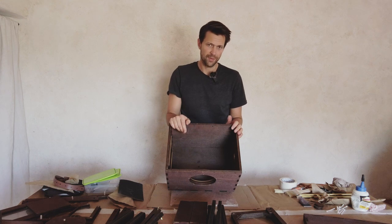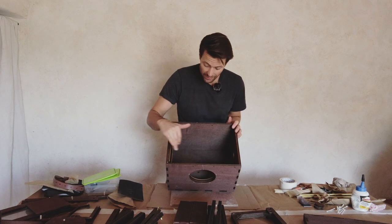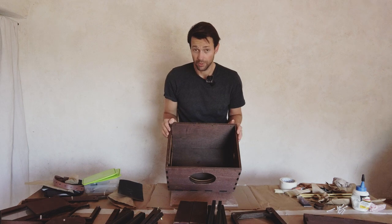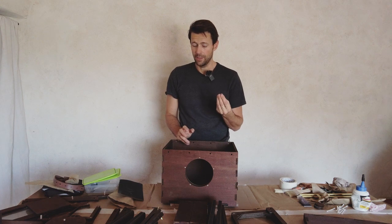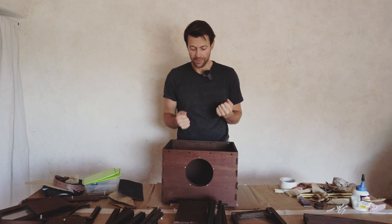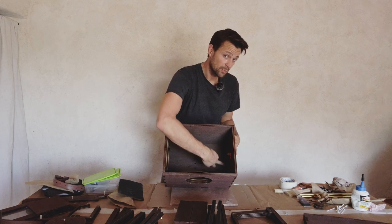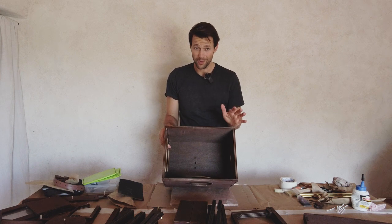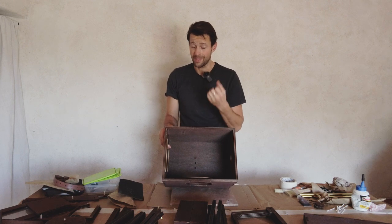Make sure you've cleaned out all the dust, and then just go ahead. What I'm using is a clear water-based varnish. Oil-based varnish takes a lot longer to dry and stays tacky longer. I'll do a layer now and later decide if a second is needed — it is good to do a second layer anyway, especially on the floor of the box and those side gaps, because we are using chemicals there and they will always spill.